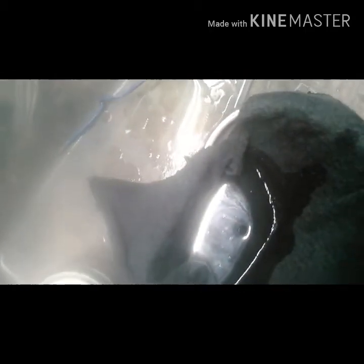As a quick disclaimer, mercury is actually pretty safe if you're not dumb about it. You can see right now my mercury is underwater and I've got it in one dish inside another dish, so that way if I spill it goes into another dish and it's easy to clean up. You keep it underwater and you don't have to worry about vapors, and if you wear gloves it really can't harm you. My retort also puts all the steam into water so no mercury vapors can ever escape.